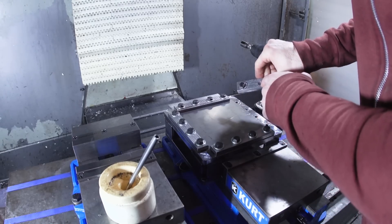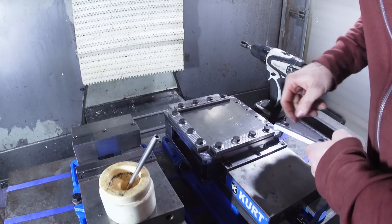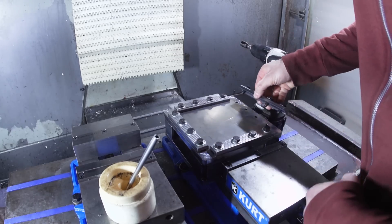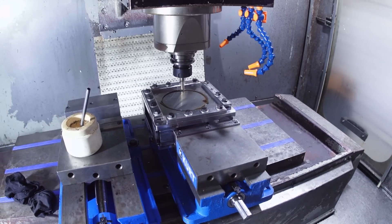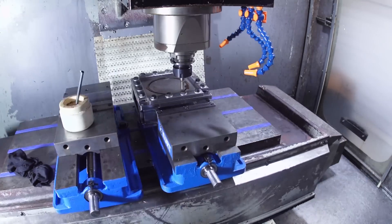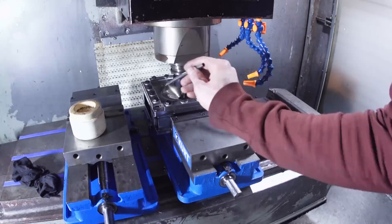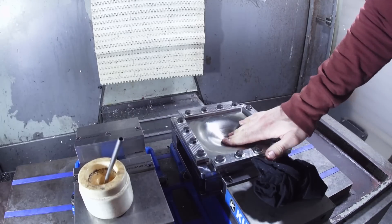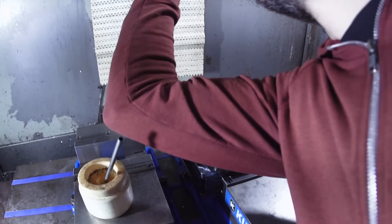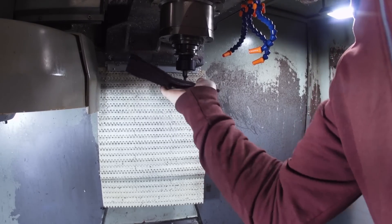In case you're wondering why there's a missing screw here, there's a broken tap and two busted end mills down in that hole — three's enough. So this is going to be a try in stainless, and it's going to be a cone; I'm trying a new shape here. It's pretty warm. A little roughness on the tool — let's see if it cleans up with Scotch-Brite.